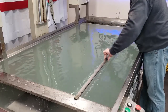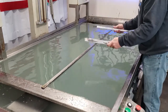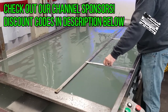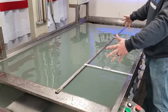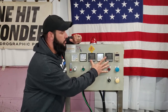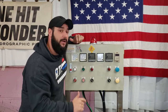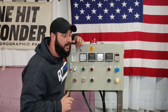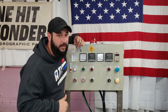My tank came with a large divider that works in the middle — I can slide it back and forth to reduce or expand my dipping area. It also came with several different sizes of pre-made dams with hooks on the end so I can pull the middle divider to whatever size I need. My tank has a total of three control panels. The main panel has two PID controllers and amp meters that control two heating elements inside the tank — one in the main dipping area and one in the sump. It also has a built-in timer I can access from the quick access panel to time how long I have water on the film and how long I let the activator sit after activating.